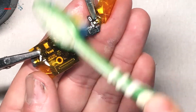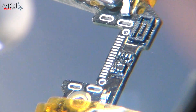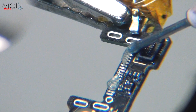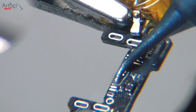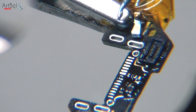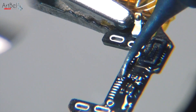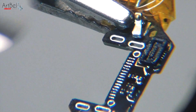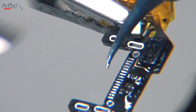After this procedure, again clean everything with alcohol. This is how the board should look — like new, but without a connector. Next, take solder on the tip and transfer it to the interface contacts to tin them. If the solder sticks together, add a little more flux and warm it up better. All contacts should look neat and the same.